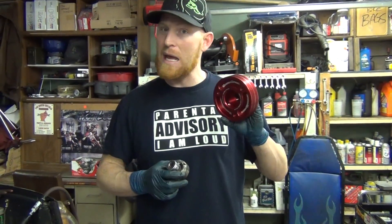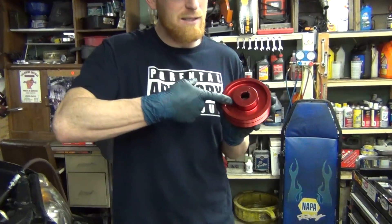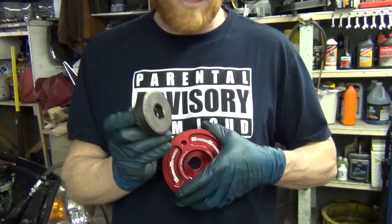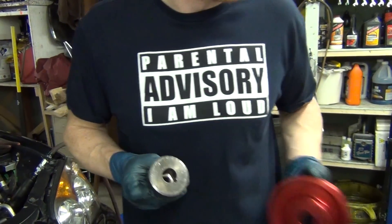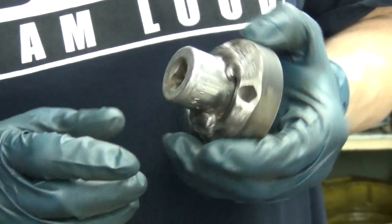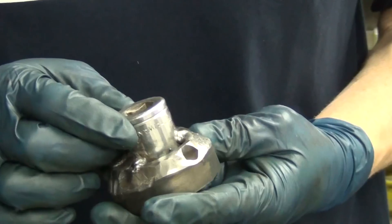I took the old one because the customer had the old one — I said, 'Hey, can I have that?' So what I did is I took my plasma cutter, put it at an angle like this, and cut all the way around, cutting out the old one so that I have basically the same thing. You can see the Woodruff key, or Cotter key, whatever. Then I took a 31/32" socket that you never use for anything and basically welded that into it and trimmed it up.